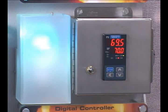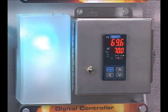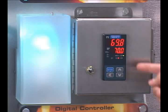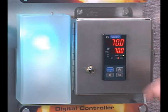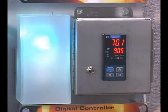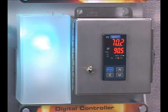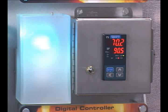This is an example of our PD540 series of controllers, in this case a PD546. The process variable is displaying the temperature being read by a thermocouple. The set point is the manually entered value that I want to control the process variable to. To change the set point, I use the front panel push buttons, and once my new set point has been entered, I press the set enter key to confirm the new value. Other ways to change the set point include digital inputs or serial communication options; however, entering it manually is the most common approach.